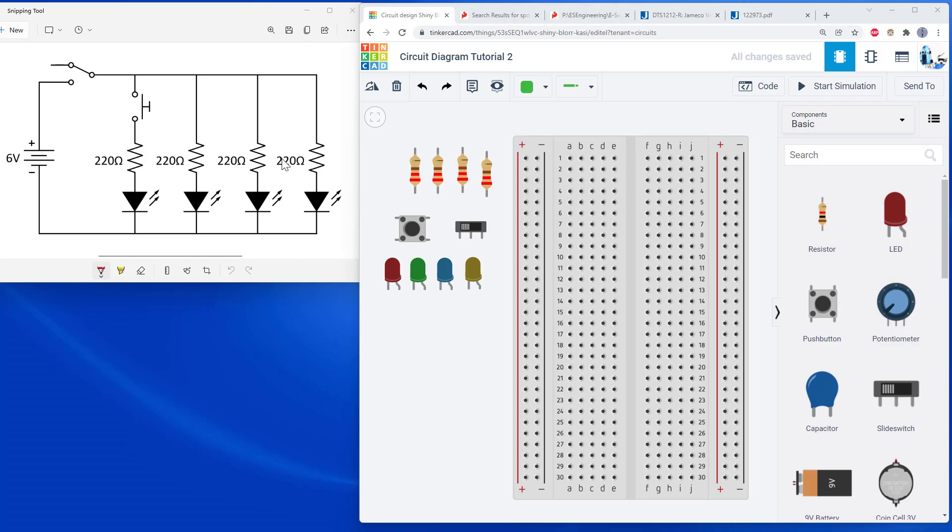The physical layout on the breadboard does not necessarily have to match the circuit diagram. In this case, since we have four branches that are pretty similar — a resistor in series with an LED, and one has an extra button in series — it might make sense to arrange four similar branches on the breadboard. If I know this is all I'm going to build, I could space things out; if I'm adding more later, I could keep things compressed towards one side.